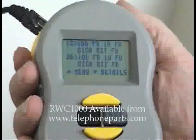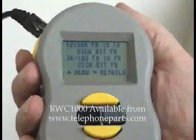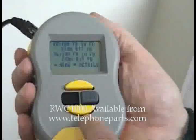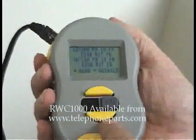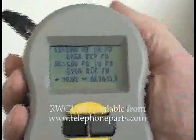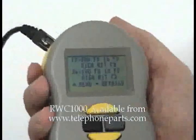This is the kind of thing that really makes my eyes light up. I see so many people who are testing cables with this tester that look at it as primarily a cable device, and then they get a screen like this that pops up. You can actually go and read the link pulse of your network device, and it'll tell you exactly what the capability of the device is. It's a strong feature — in fact, some people just use this device for that feature.